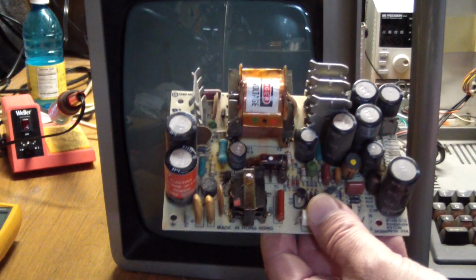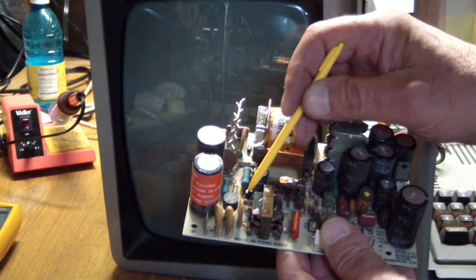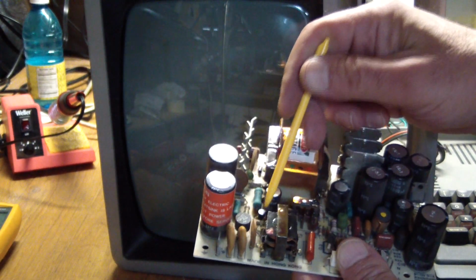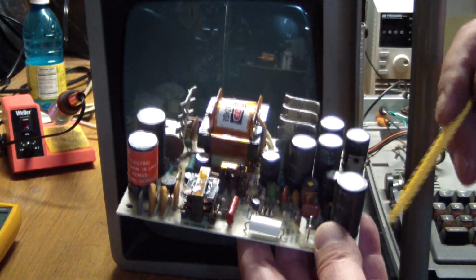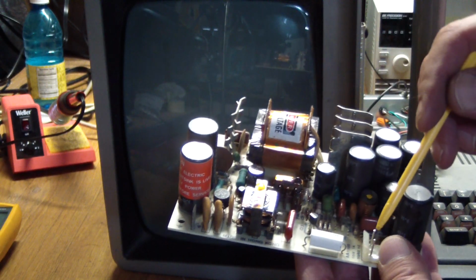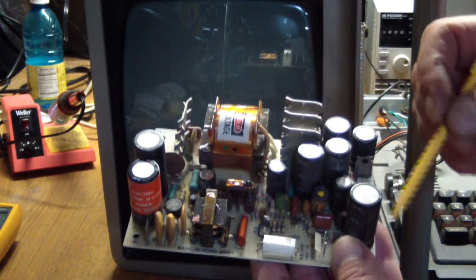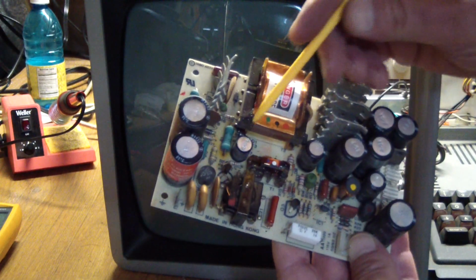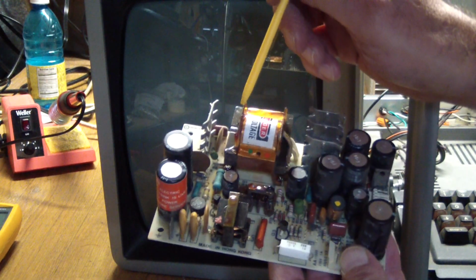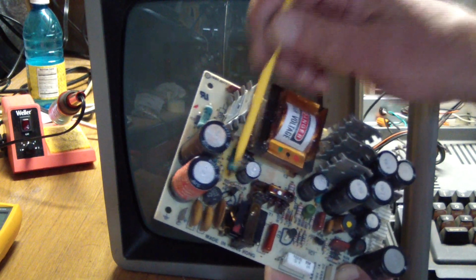I worked on the defective power supply for a while, and this was the transistor here that blew its top. So I replaced it. I clipped on a fuse here, even though this is a resistor fuse. For testing purposes, you can just put a fuse across it because this is open. And this resistor, let's see which one, yeah, this resistor started to smoke.